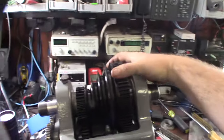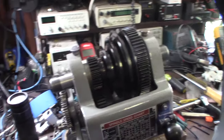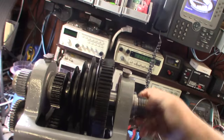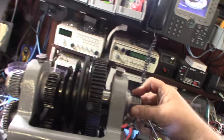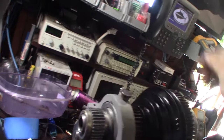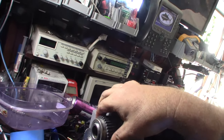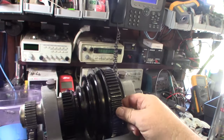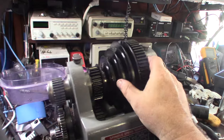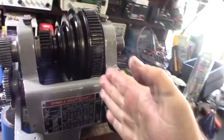Now I have a set screw to align it with the bottom gear, and I need to line it up with this bottom shaft here. You could probably do it with a dial indicator. The main thing is you don't want play but you also don't want it too tight, because if it's too tight it's going to overheat the bearings. If I clamp it down any tighter the bearings start to bind with too much resistance. These bearings are adjustable - you can go back and forth to get end play set up correctly. The collar on this side and the set screw on this side keeps everything aligned for the back gears.